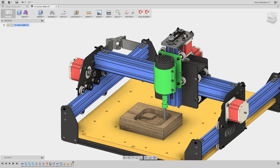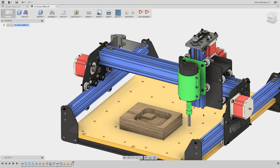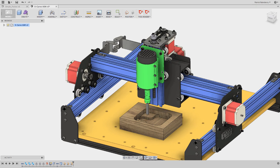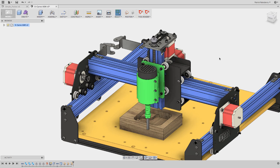But what if my machine was over here when I turned it on? If you don't home your machine and you turn it on with the spindle somewhere arbitrary, Machine Zero gets set to wherever the spindle is at the time you turn it on. Then it would say G28 is zero in Z and one inch in X and one inch in Y from this arbitrary point. So if it thinks this is Machine Zero, G28 is going to be somewhere completely different. That's how you end up crashing into your material, as I did the first many times I did this before I understood how to set up G28.